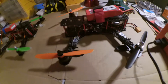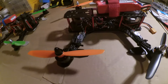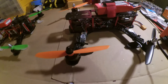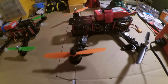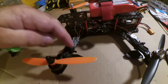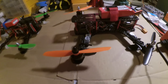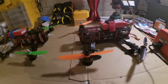The Mini Quad Bros ESCs are DYS ESCs with newer BLHeli firmware — they support OneShot125 and damp light, so it's more advanced and definitely more cutting edge. I've also got bullet connectors on here, but those will eventually come off and I'll do a direct solder. The solder points are all right here so they're very easy to access, and if you mess one up, you don't have to scrap your motor like you might over here. ESCs definitely go to the Mini Quad Bros kit.